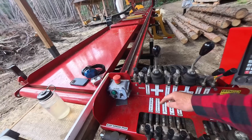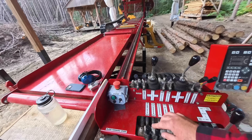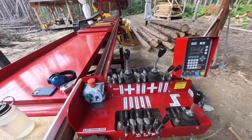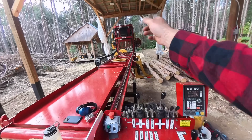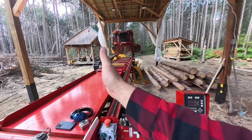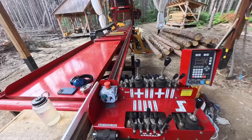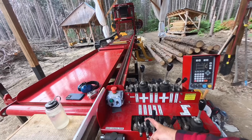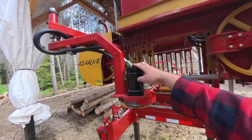So that's what's nice about this. Just so you know what I'm talking about — there's the debarker. For the blade to start spinning, the blade would be spinning there in and out. Currently it's in the in position, and if I hold it in it goes to a detent and that keeps it in, so there's pressure being applied against the log. I can control the amount of pressure — if it's putting too much pressure I can ease off, if it's not applying enough I can increase it. That's with that detent. Put it back to neutral, and if I wanted to bring the debarker back out of the way I just hold it back until it's out of the way and let go, then turn the blade off.